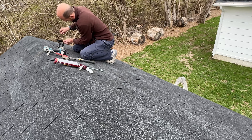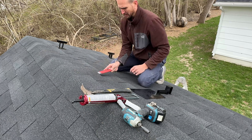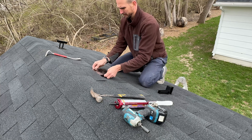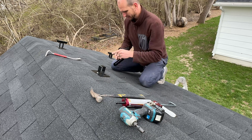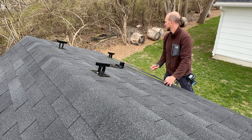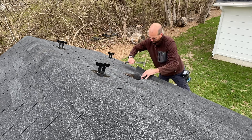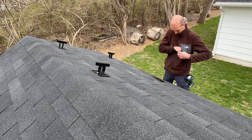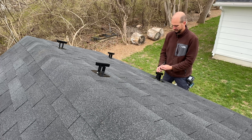I'll go through on the second side — this one is pretty close to the ridge, and I wouldn't want to get any closer, but it gives me my 39-inch spacing, which is the width of my solar panel. Don't forget your sealant on each one of these, then set it in place and keep going through each step, taking your time and making sure you have secure connections. For my last location, I transferred the measurement from inside — that was actually 48 and three-eighths inches opposed to just 48 inches because the rafter was a little bit off. Drive those two lags in and we finish up our four locations.